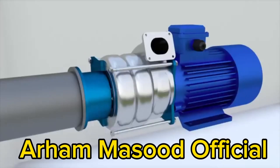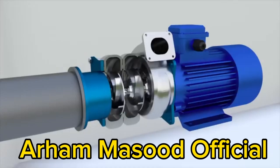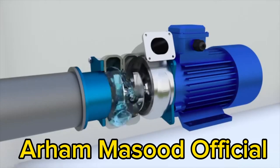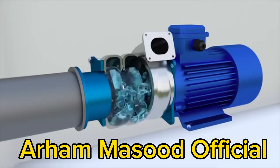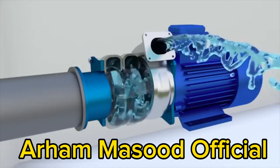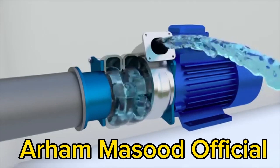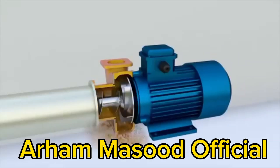This scheme is relevant for pumps with high capacities, as the pumping units are installed in parallel. Multi-stage centrifugal pumps: by installing pumps in series, the head of the liquid can be increased. Pumps installed in series can be combined by placing several impellers in the same casing. The liquid will go from the first impeller to the second, from the second to the third, and so on. Using a multi-stage arrangement can increase the head of the pump many times over, as each impeller increases the head.